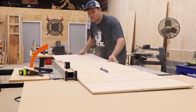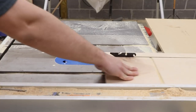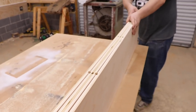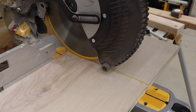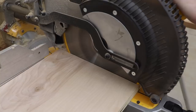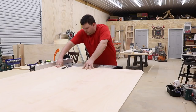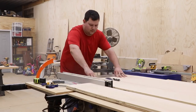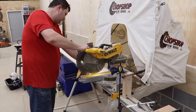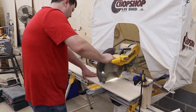After I cut the dados on the center sections, I rip them through the table saw to their final dimension. I then clamp everything together and mark it to make sure all the dados line up and the faces are all the same, then cut them to their final lengths. The two center sections I cut that top dado all the way off, and the outside ones I cut it where the dado is still there so the top piece can cap the top of the shelf. I then rip all these boards down so that they are the horizontals on the shelf, and make a stop block on my miter saw and cut them all to size.